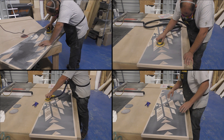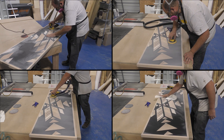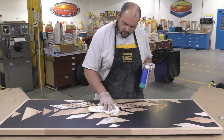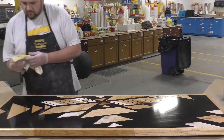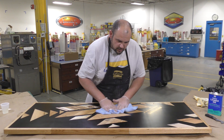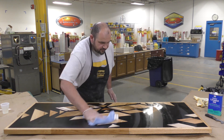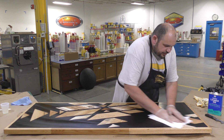Keep in mind the aim here is a matte finish, not a gloss finish — sanding to 1000 grit gives a semi-gloss matte finish, which is exactly what we want. To finish the project, apply some linseed oil to help seal the wood. Rather than any spray coating, linseed oil seeps into the wood for nice protection while preserving the semi-gloss matte finish of the epoxy. Once applied and allowed to seep in, buff it out and wipe it down — the piece is now ready for installation.